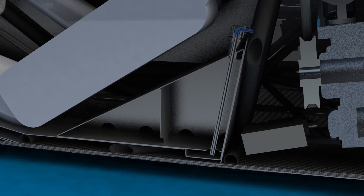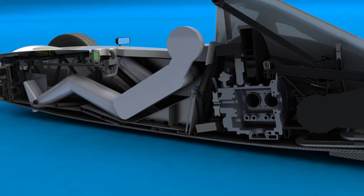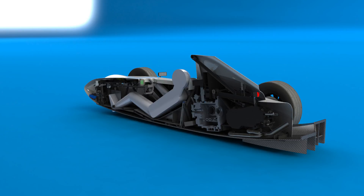The tank was constructed from laser-cut aluminium plate and, like quite a few other Formula V's out there, was located behind and below the driver's back, essentially forming the back of the seat. This has the advantage that it's right where the car's centre of gravity is, meaning the car's balance won't shift as it goes through its fuel load.